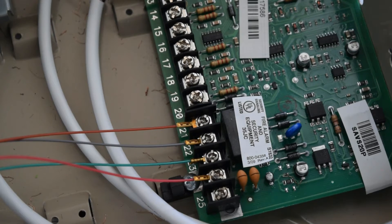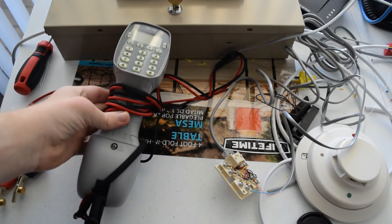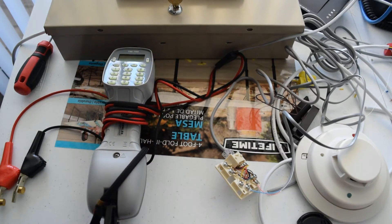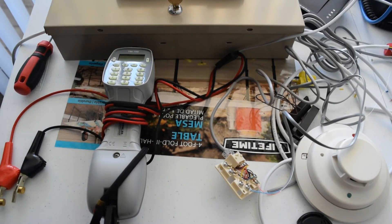We have just finished wiring up the panel with the telephone line. Now, the moment of truth — an operational test. I also have my telephone test set connected in series with the telephone line. I'm going to make the panel do a manual test report: enter the master code and then hit number five for test and make it do a dial test. And there we go — we have just verified that the panel is able to get phone service and therefore is able to make a report. It is communicating properly.